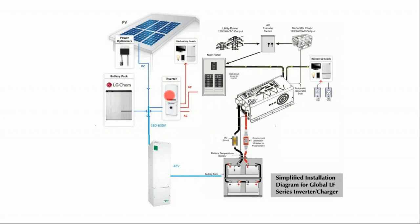In a commercial setting, they'll communicate with the consumption meter, like what we saw in our home automation, and they'll say, okay, whenever the building load is above a 100 kilowatt demand level, let's turn the battery on and shave off peak demand from the building facility. That's how a lot of commercial businesses are charged for their electricity, and using batteries for peak demand management can be quite cost effective. Using my digital control system for demand reduction is even more cost effective, but batteries can make further inroads and work together for that matter.